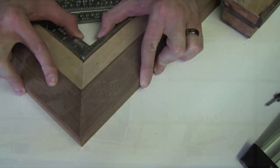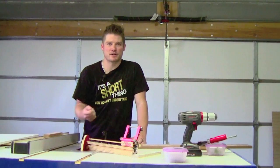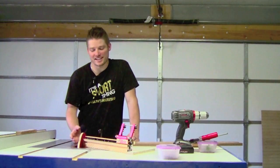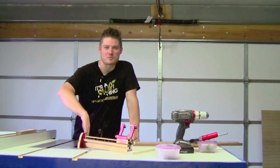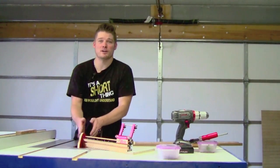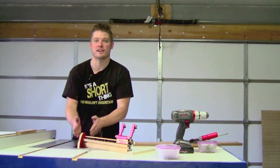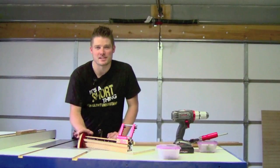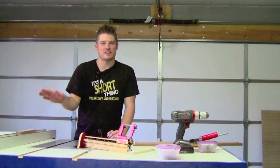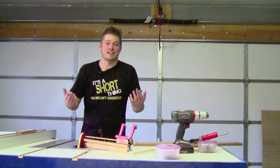Now that looks like a great joint. The other cool thing about having this sanding disc in your table saw is that you can do angled sanding by tipping the blade up to 45 degrees. And it's two-sided — once you're done on the 60-grit side, come around to the other side and work with the 150-grit. You can put whatever grit you want on this disc: 220, 120, the possibilities are endless. When you want to change it, just peel off the sandpaper with a little mineral spirits, let it dry, spray on another coat of adhesive, and apply new sanding discs. It's cool and it's cheap.